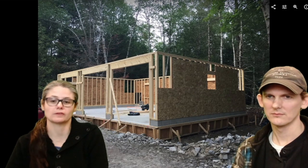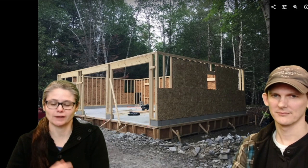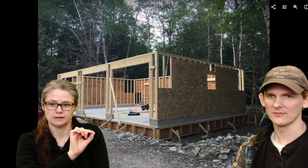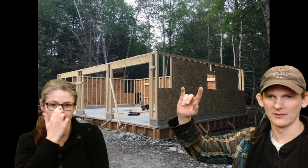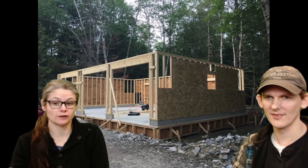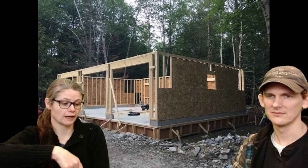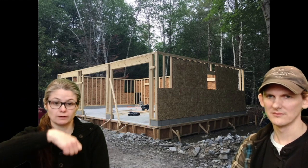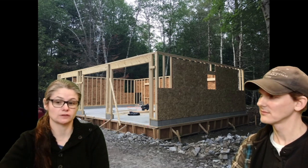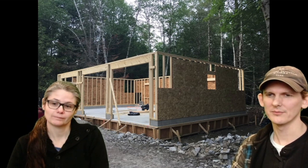Now, as we got to the second tier, he put a couple of nails in, right in here and here, and he put the board on top of it, balancing on the nails while he nailed it. Then he couldn't see where the nails were, so I had to go on the ladder on the inside with a string with a weight that went down to show him where the 2x4 was so that he could nail it into the 2x4. Remember doing that? Yeah, but I think that was at a different time.